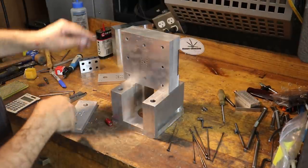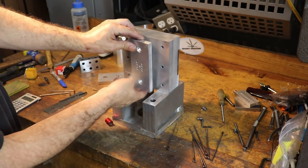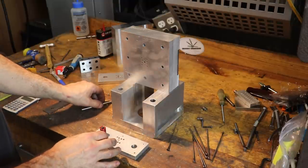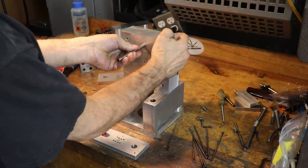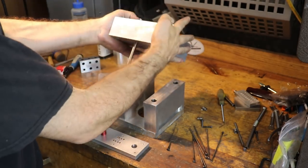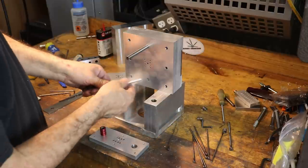Okay, so we are ready to stick our ejector pins through our plate, but first we need to hammer in the linear rods that will align the ejector plate with all the pins to push out the part, with some pressed in bearings. And hopefully these don't give us as many problems as the other ones did. I think since I've got this in my hand, I will go ahead and press in this guy. As I recall, this was almost a hand press. So let me just tap that guy in, and it will be retained when we bolt the whole mold together, so it's not really gonna go anywhere. So that made life a little easy.